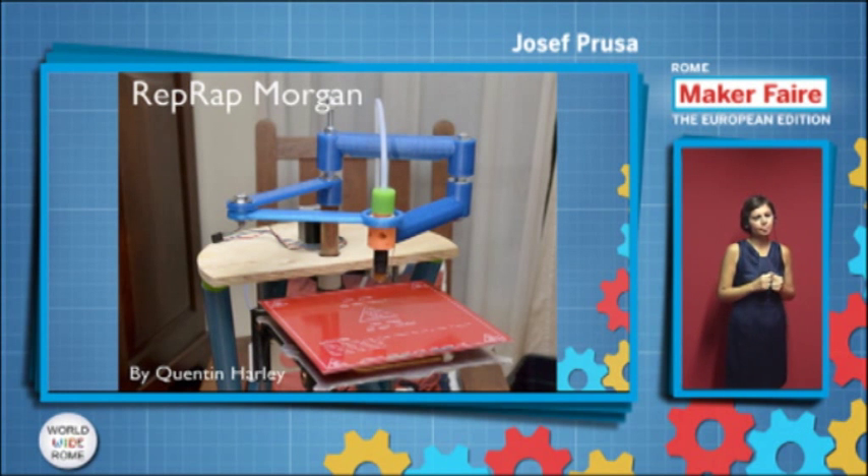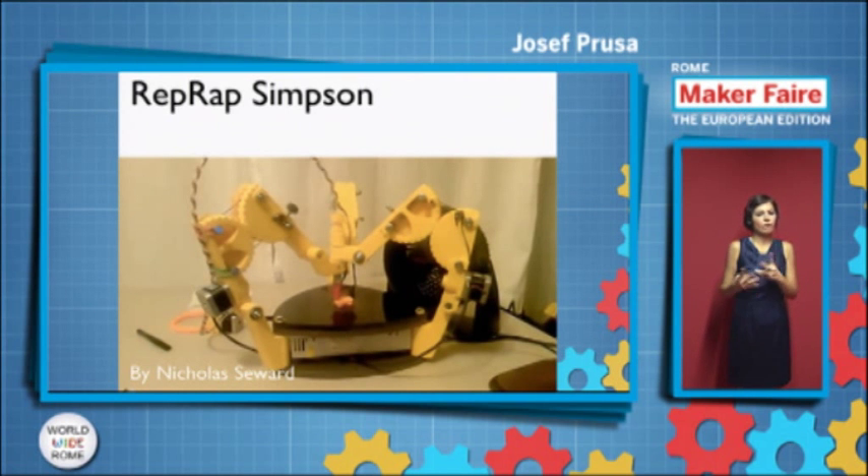Now, something interesting for those of you who already use RepRap — we have some really cool new designs. This one is called Morgan; it won the GADA prize. What I think is really cool about it is the fact that all the mechanical parts can be hidden away, so it will be a really wonderful food-safe printer — you can print safe toys and stuff like that. Another one is RepRap Simpson, done by Nicholas Seward, and this one is almost 90% printable. A lot of people don't like the fact that we still use threaded rods, and it's a valid question why we don't have printed ones — but we do. Unfortunately, it takes around 60 hours to print this one. But if you have a lot of time, or you're in the middle of Australia and don't have a hardware shop nearby but have a ton of filament, you can build another printer almost for free.